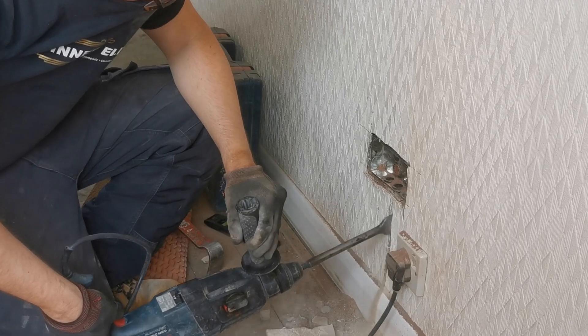It can be quite hard to run a cable from point A to point B. Sometimes you have to drill through loads of joists, which is quite time consuming. Other times you can just run straight down the run of a joist and fish it in — that takes maybe five minutes. Chasing out into breeze block might take five minutes, but chasing into hard brick could be half an hour. We'll just see what we come across.